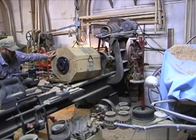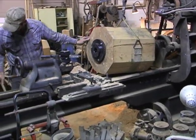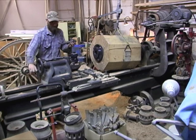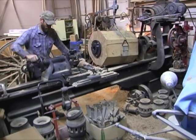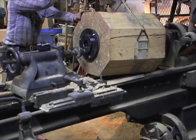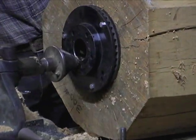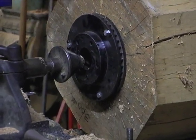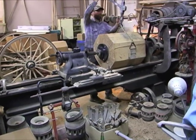The rotor on the other end we will attach to the tail stock with a bull nose attachment that will go into the tail stock and into the hole of the rotor, thereby centering this block so it's turnable. With the come-along we can drop it down into position to where we can actually get the center into it, and that's what's going to carry the weight of this block as we start turning.